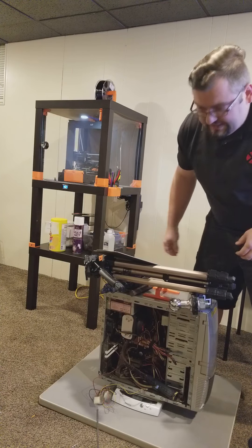Grundle Stiltskin said there will be no good way to print this — I just printed it flat. The only thing I'd recommend is printing it with supports to stop drooping in the center, which happened on my first print. This is 50% infill; the original was 30% infill which felt kind of light. 50% infill is definitely the way to go. I'm using Hatchbox PETG orange. Supafly said the weight when picked up will separate the printed layers — I had a lot of downward force and it didn't break. So yeah, I think this is a good print. Print it out and stick it on whatever 120 millimeter case you have — it hasn't broken for me.